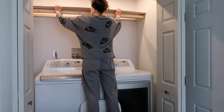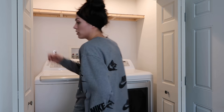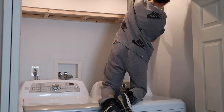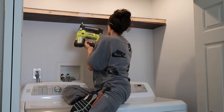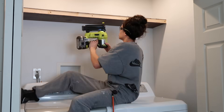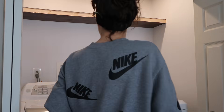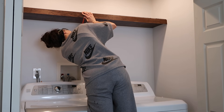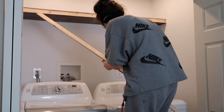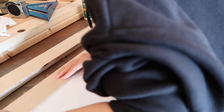In my floating shelf tutorial I didn't cut the edges where they meet at a 45-degree miter so it looks like a solid piece of wood — you can see the end grain because I didn't really know how to do that at the time. Mike from Modern Builds shows you exactly what to do: he tapes and glues it together so it's a sleeve that can just pop over. I am just going to directly nail the wood into the 2x2 frame. This piece was way too big so I needed to take it back home to the table saw and trim off a little bit. You will see me wearing the same thing for the three or four days I worked on this.